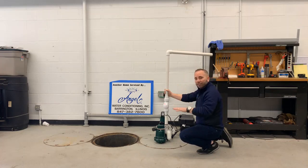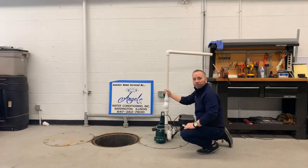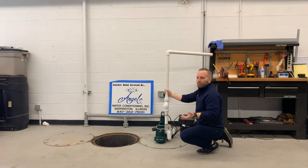Most homes don't have that high an aquifer, but as rain falls, aggregate water comes against your home and the sump pump level goes on and off constantly. You always want a very durable pump. We've had many clients who bought a new pump — put it in themselves or bought one online — and within a year it's failing. If you have a finished basement or something of value down there like a furnace sitting on the ground, you really want to consider a high-end pump.